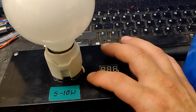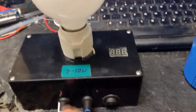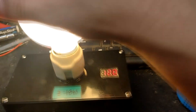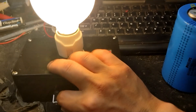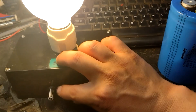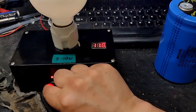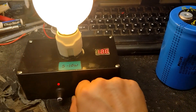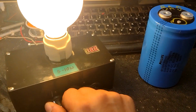I basically found a window of voltages that I could adjust that would give me a nice variation in my output, and I could also current-limit it through that voltage range. I've got a 12-volt battery in there and right now it's cut down as low as it'll go. If I cut the voltage up I can get it a lot brighter and current-limited, so I can limit the current real low and have that voltage range of adjustment.